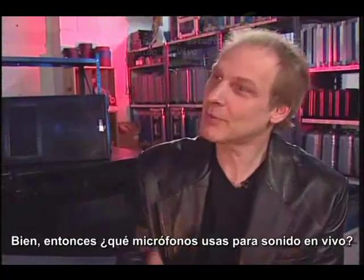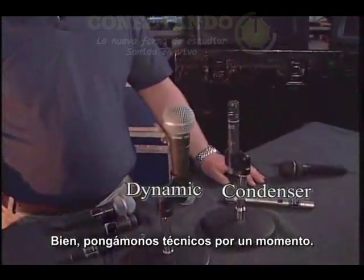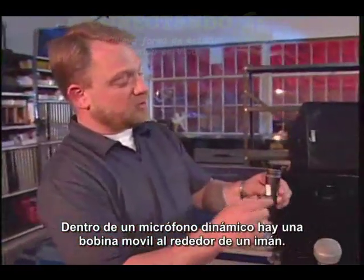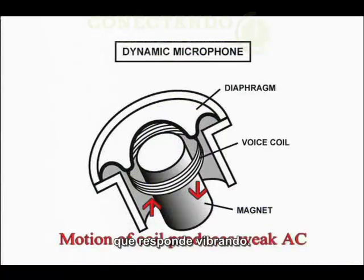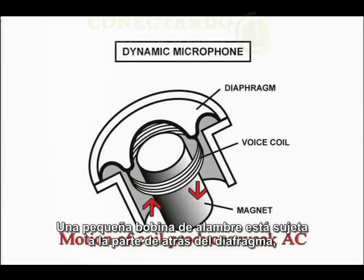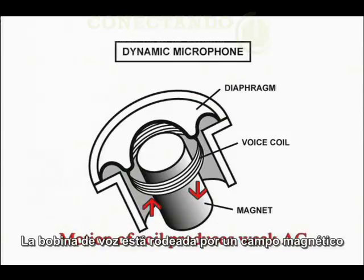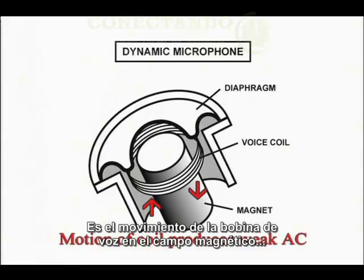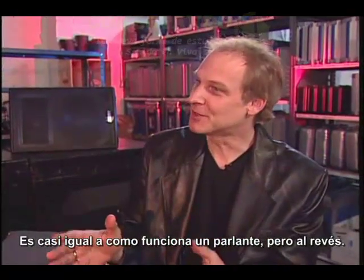So don't use ribbon mics. What mics do we use for sound reinforcement? Primarily dynamic and condenser mics. Inside a dynamic microphone, there is a moving coil within a magnetic casing. Sound waves strike a thin plastic membrane or diaphragm, which vibrates in response. A small coil of wire is attached to the rear of the diaphragm and vibrates with it. The voice coil is surrounded by a magnetic field created by a small, permanent magnet. It's the motion of the voice coil in this magnetic field which generates the electrical signal - that's almost exactly how a loudspeaker works, except in reverse.